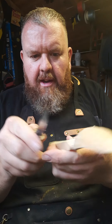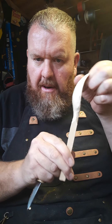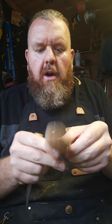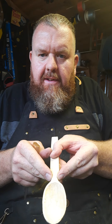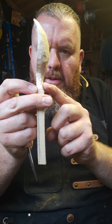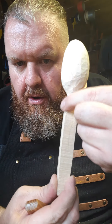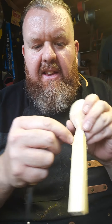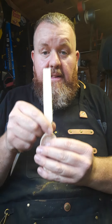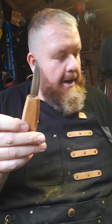You've got a transition. I like to keep a ridge on the back — you don't want it too thin, because this is the working part of the spoon. To try and get it thin looks elegant but it's weak. So go as thin as you like, but try to keep some meat on the back. You can still look elegant if the transitions come to the sides. Then you can shape the handle whichever way you like. Remember, keep your knife stropped up.